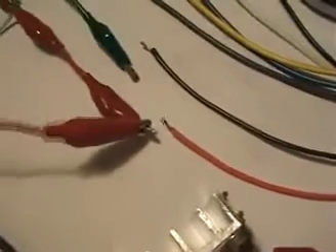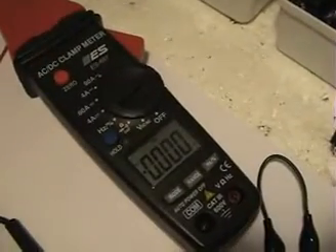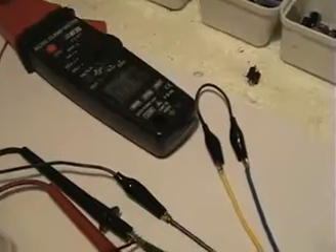The negative here — I'll turn off my 12 volts, put this back where it should be — and this is going to connect right here. These leads come back. Okay, the meter is still at zero, and we're going to change the scale now to AC, because basically we'll have AC-DC: it'll be the DC that's pulsed.